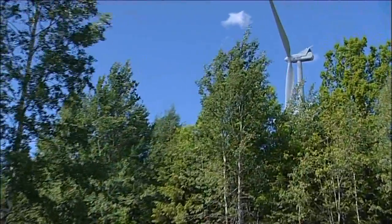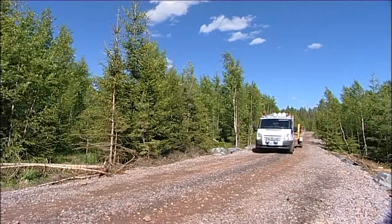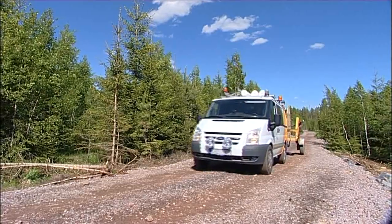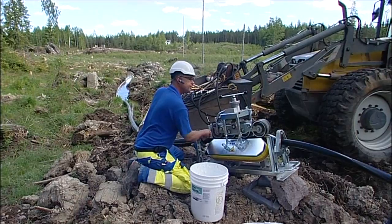The push and pull concept reduces the cost of laying cables by coordinating with other excavation operations. The method to winch and propel a cable through the pipe is thorough and safe, using light and flexible equipment.